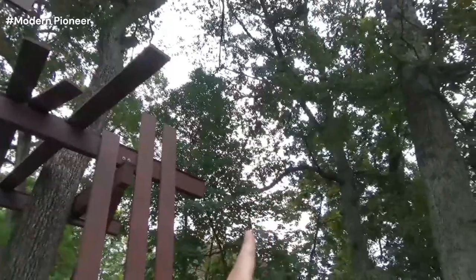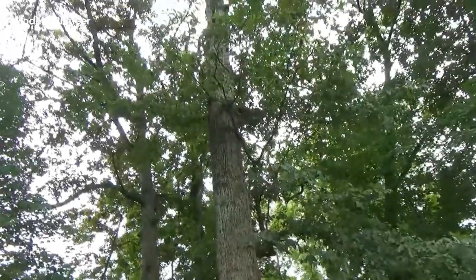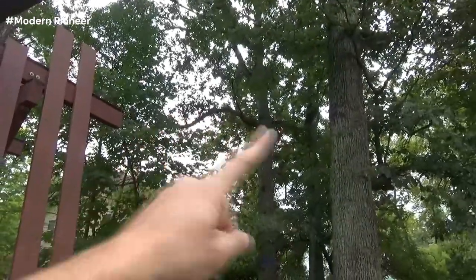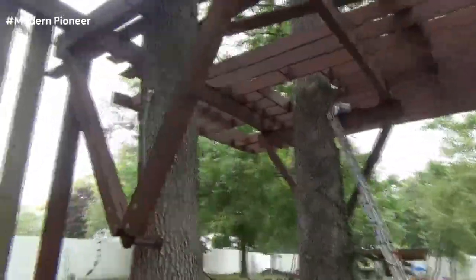It's gonna cut back at about a 45 degree angle. The reason being is because here I'm gonna put a slide, one of those tube slides, and so between these two, decking and that tree, I'm gonna put a little rope bridge. So in order to make some room for that thing, I'm cutting the corner off of this deck. This corner is gonna continue out all the way to about right here. Not as far as the other one, because there's really no reason for it. So I'm just doing that.